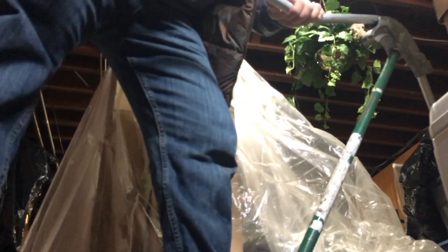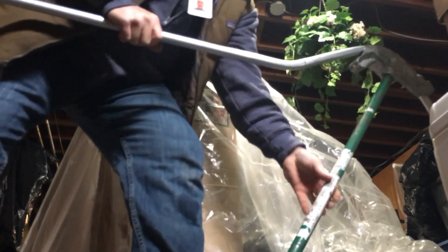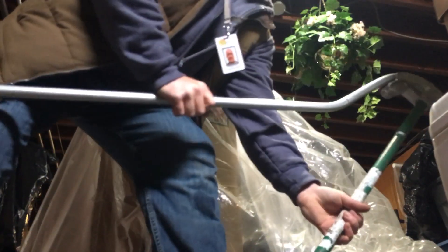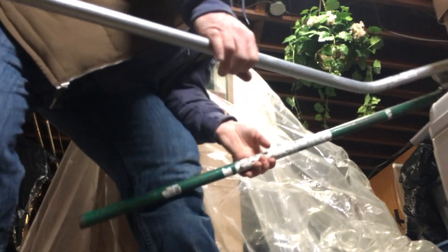Up and down, use your good eye. Keep bending, keep bending — when that's perpendicular to that pipe, and that 90 is squared to that straight pipe, I'm going to have to do it a couple of times. This bender is almost going to go right to the floor — don't worry, a little muscle.